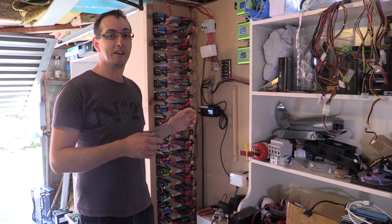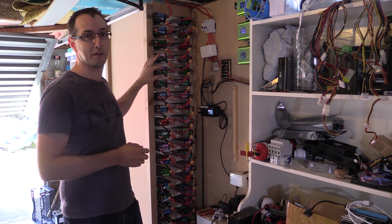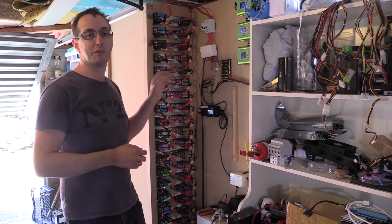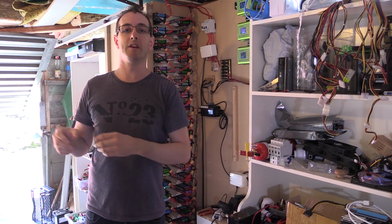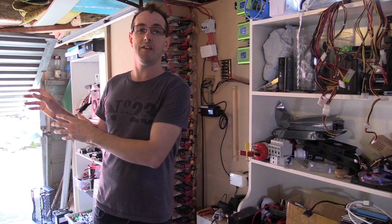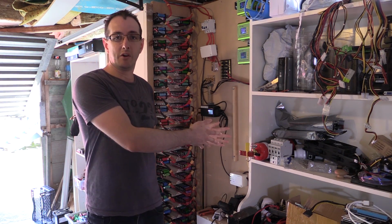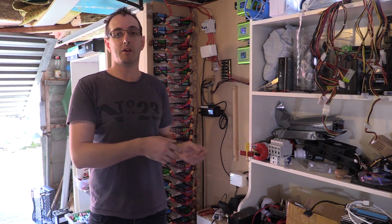And what it will mean is that in stage 2 later on, we'll leave this other bank in here for now, and we'll come back to that after we've got the battery box, the hybrid inverter and everything running on 48 volts. We're going to be 10 kilowatts over there, and we'll have 5 kilowatts just sitting here. Obviously I'm still working on the good time inverter that failed, as per a couple of videos ago, so I'm still working on that.